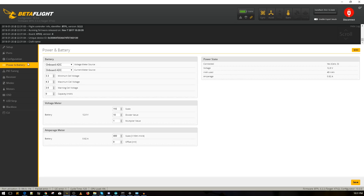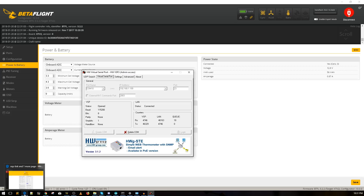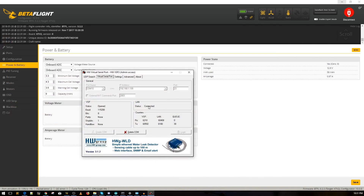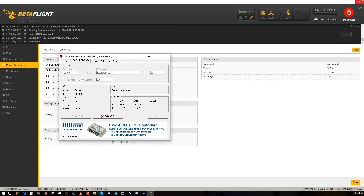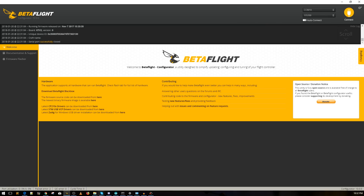In the field, as long as your PC is connected to the ESP Wi-Fi network, you have full access to Betaflight. If you get disconnected, just reconnect to the Wi-Fi and restart the virtual port. If you pulled the battery, open the program again, delete the COM port, and recreate it. Keep the browser tab open and refresh it — if it loads the config page, it's working.